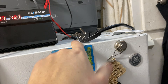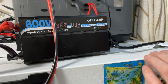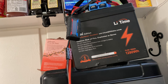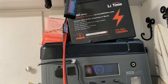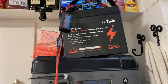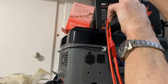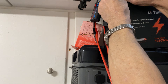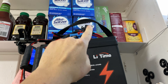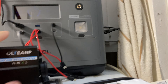Let's reconnect and check power consumption — it's 6.5 watts at idle. Then something happened: I think I may have overloaded the fuse. By connecting just one wire, we sent too many amps — inrush current — through the fuse. The fuse is rated at 40 amps, and the inrush current was probably much higher than that. I need to replace the fuse.